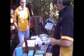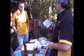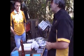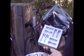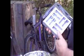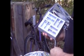That's right, yeah. So this is the other type, which is what they call a resin saver moulds. This is run by New London, who's a member of our forums, and he's a member of the IAP as well. And this is the other type, where the plugs are already there, and again you put in your tubes. These can be cast up to 20 psi without any trouble, but any more than that and the resin just gets into the tube and fills it up. But like I said, you rarely need that.